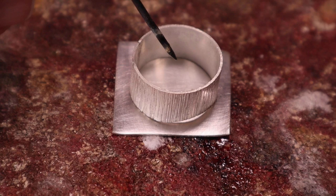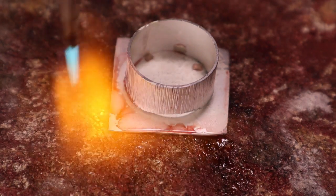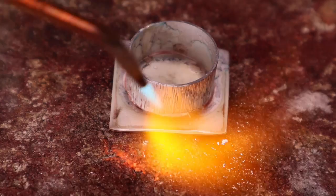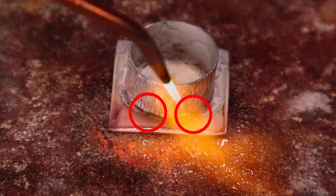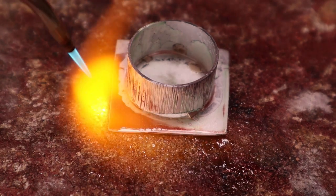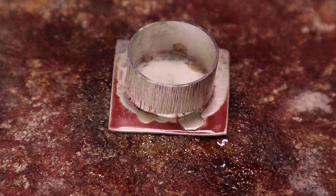This sheet silver seam is common in jewelry making. Rings and bezels use this technique often. This example has a gap. As you can see, the solder flows with no problem along the seam, but at the gap will only flow onto the back sheet. Even putting more solder into the gap will not fill the gap. Take the extra time to file and make a good fit to avoid this messy soldering mistake.